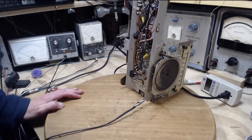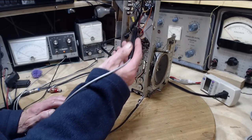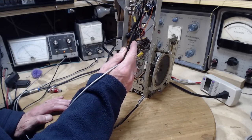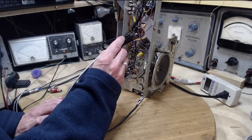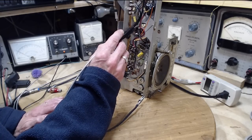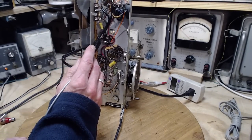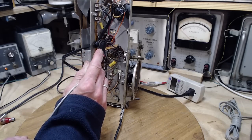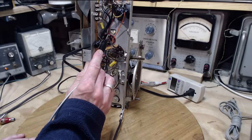Okay, so we'll measure them at the tubes. The output tube is that guy there. Here we want to see the high B plus. See it right here. 15 volts cal. That's 40 volts. That's the low B plus. There's the high one. Okay, I just picked the wrong one. Yeah, see, it's going out this wire, going through a hole in the chassis, up to the output transformer in the speaker. So this is the plate. So the plate is cooking with 140 big volts on it, so it's getting lots. But the other circuit is low at 40 volts. 50 volt scale. 45 volts instead of 80.